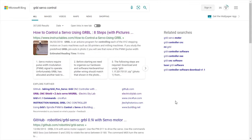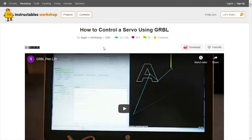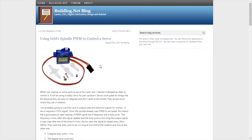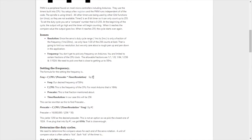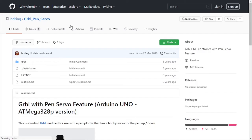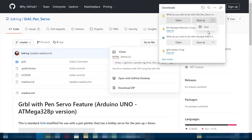Now if you go back onto the internet, find this Instructable in the description below, and I mentioned we'll have to make our own custom version of GRBL. So, as you can see, here are the steps. We already have GRBL. Clicking this link, we'll need to find a special program to control the spindle, because mostly in GRBL there is a spindle control. We're going to be using that to do our servo. You can find it all in the GitHub repo. Just download that and just save it.